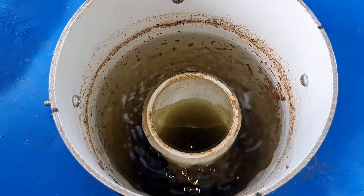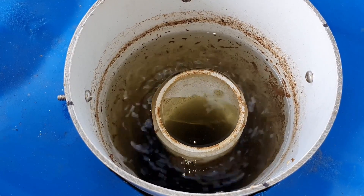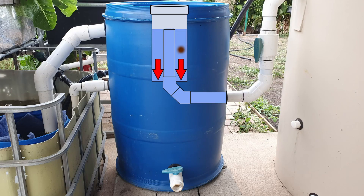Now this stilling well has a larger volume of water in it, so the entering water slows down in velocity slightly and it is then redirected downwards towards the base of the stilling well. There, that water with the solids in it is introduced into a larger volume of water so the velocity slows further again, and the majority of the solids will then precipitate out of the water column and settle on the base of the vessel.